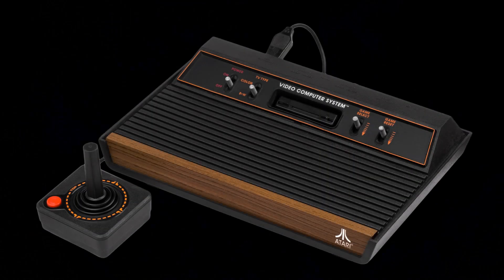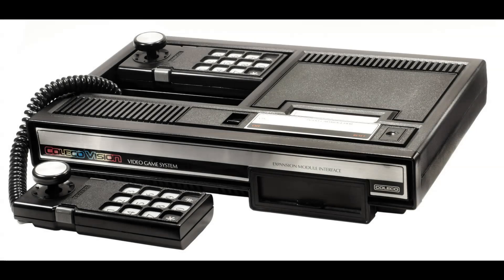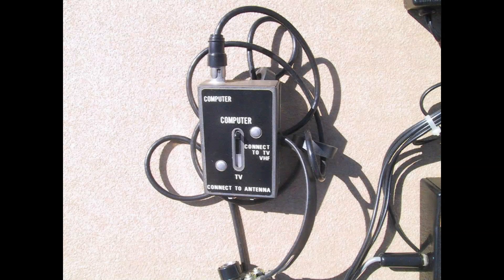Going back into the early years of gaming, as far back as the 70s and 80s, we had the Ataris, Intellivisions, Colecovisions, and even extending out into the 90s and early 2000s. Our gaming consoles had built into them what was called an RF modulator. These RF modulators took video and audio signals coming off the chips inside our gaming console and combined them into a frequency we could send to a switch box connected to our cable TV and TVs, so we could start playing our games.